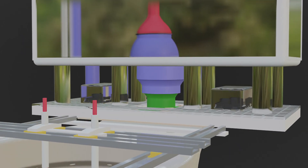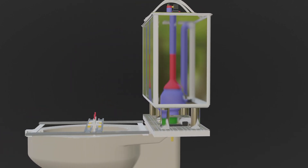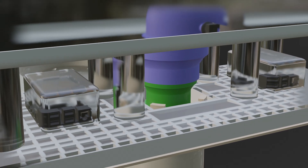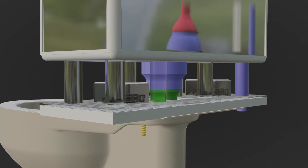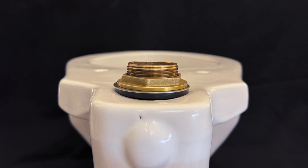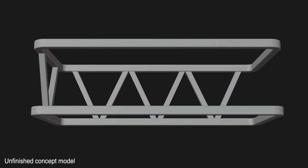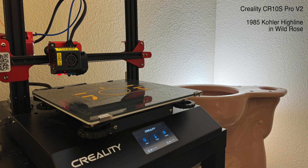But thinking ahead to our actual tank system, what does a nice level surface get us when we have a tank and support design that could just randomly tip right over? After a number of sleepless nights imagining worst-case scenarios, we recently took a really hard look at our sandwich design and threw a good portion of it right out the window. With our use of a slip joint connection as part of the design flaw fix, along with dealing with the pre-existing height of flushometer spuds, some minimum amount of height between tank and fixture would always be required. While we looked at a few different solutions, including creating our own bridge-style box truss structure, the center of gravity was always the biggest problem. Shorter was better, and so ultimately we went back to our own 3D printer.